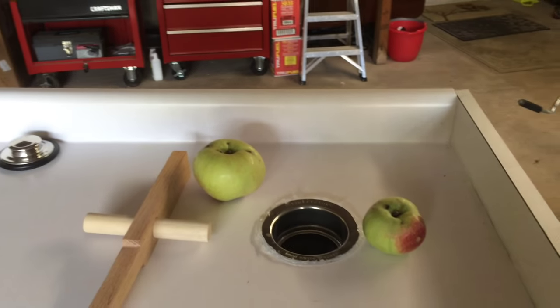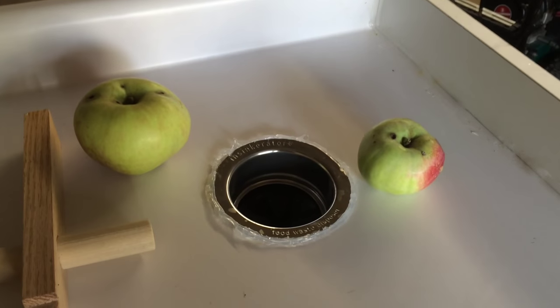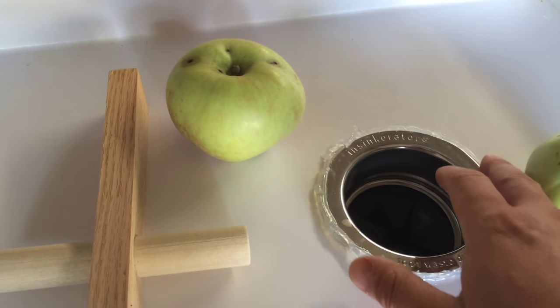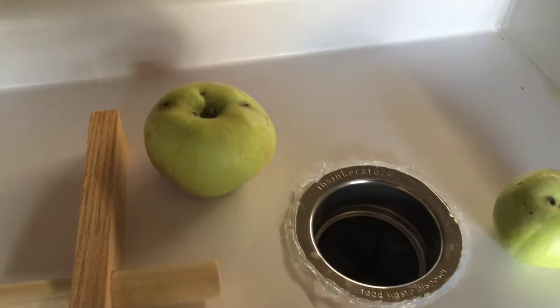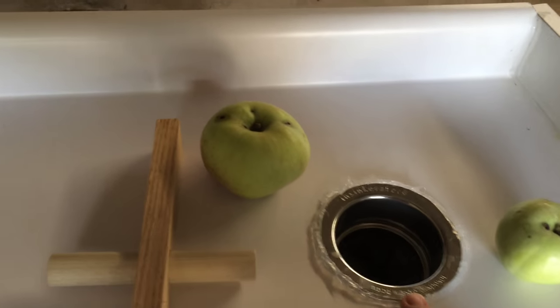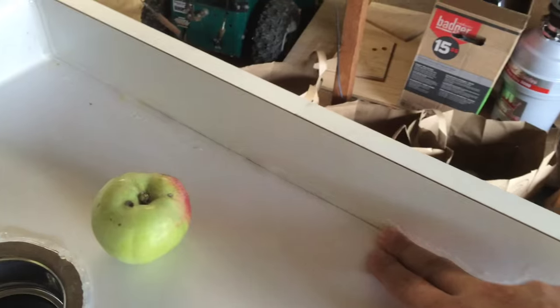The garbage disposal is not designed to mount on a countertop, so the flange does not rest neatly on top. I found there would be seepage between the flange and liquid would seep down underneath, so I sealed it with food-grade silicone — basically aquarium silicone. Aquarium silicone is good enough for permanent fish contact, so it should be fine for incidental cider contact. I also added a splash guard on the side, sealed with silicone as well.